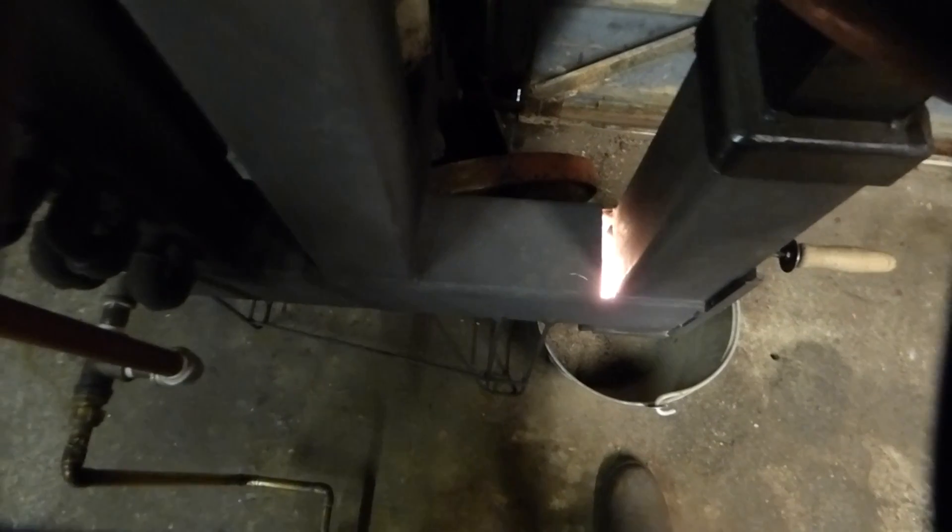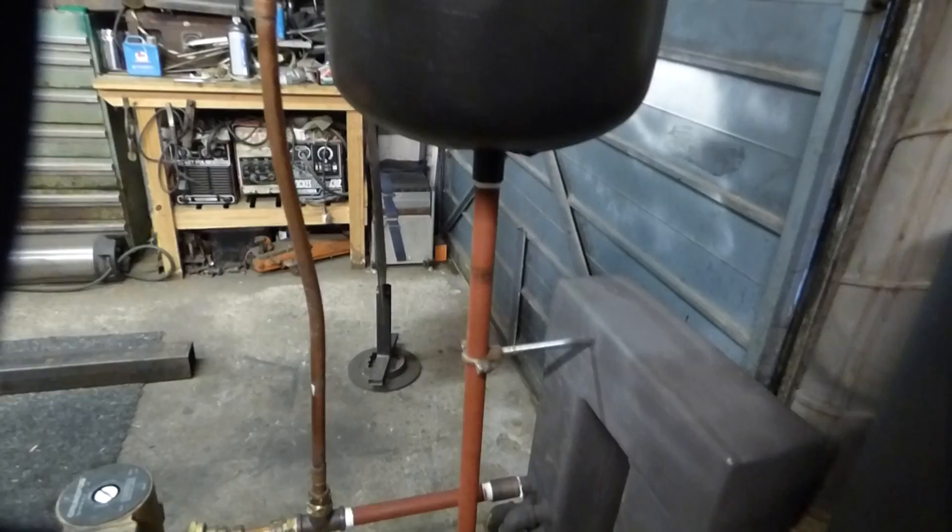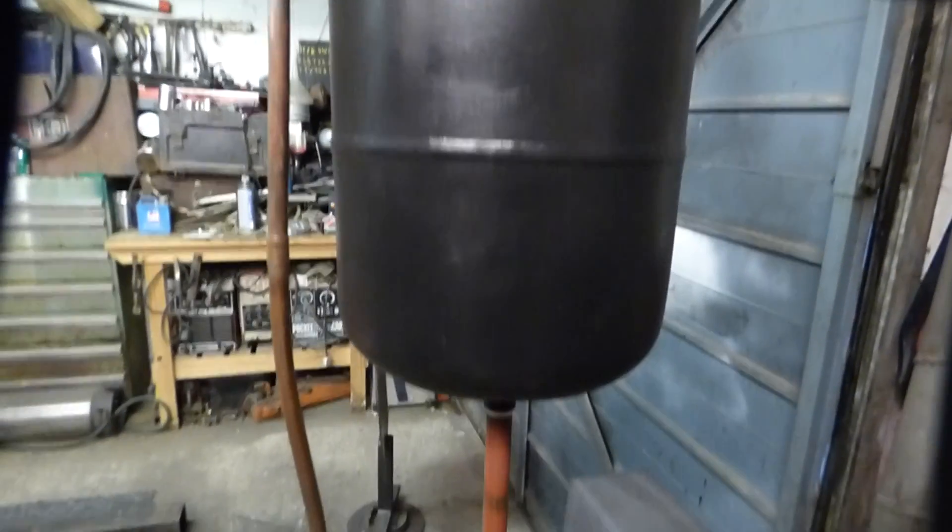It's running at 670°F — that's a pretty fair temperature, 660 to 670. If I take the door out it runs up terribly — it gets 900 degrees in that position, which is much too hot for the water. It pushes the hot water over the expansion and makes the F&E tank hot, so we don't need any of that. Believe me, you won't want to put your hands on that radiator — it is poking out some serious heat.